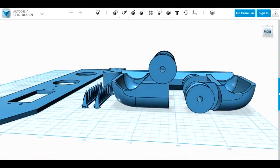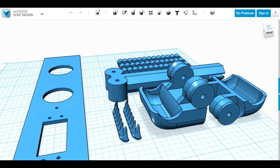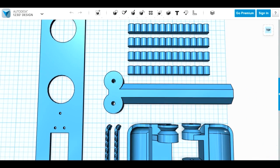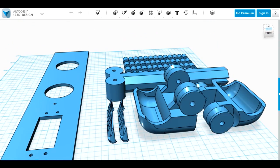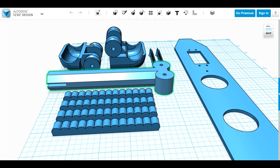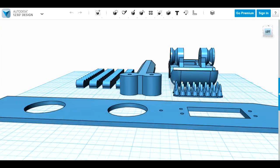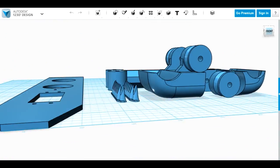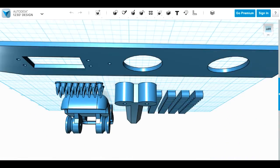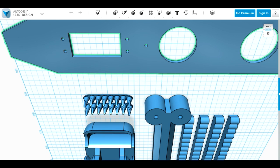Here's our first lot of parts. You can see the two bucket-shaped things which look suspiciously like the inner jaw. There are also two rows of teeth which I'm going to stick on afterwards — these parts are going to be printed in ABS so I can acetone weld those on. In the middle there's a rather suspicious-looking part and four knobbly parts which stick onto the chamfers on there. That's going to make the actual piece that pushes the jaw out, and the rotating parts of the jaw will fit onto those two knobbly bits on the end. There's a slot in the other end where this big flat piece slots in and is acetone welded, allowing it to slide on V-rollers. There's a hole for a servo in that flat part — you can just see the square hole on the very left.